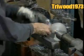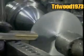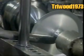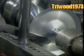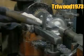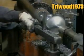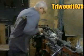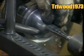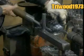When working the hand lathe, the metal spinner uses what's called a scissor tool. It's the equivalent of the plastic wheel on the automated lathe. As the blank spins, he moves the tool further and further down to stretch the aluminium into the right shape.